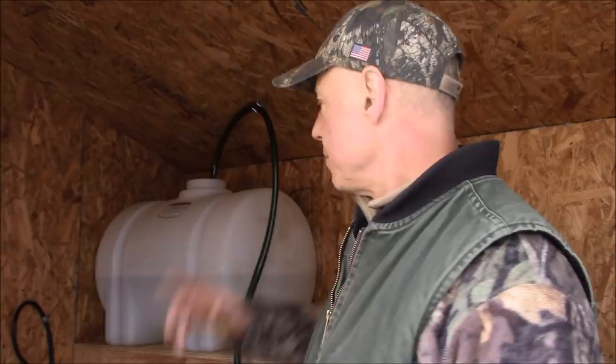I want my drum of water right here in the shed because I'm utilizing the heat generated from the propane freezer to keep my water from freezing, so I can do laundry all year long. I hooked up the system, turned it on, and those folks were right — the water would not go into the drum. Plan B: I've got 12-volt pumps salvaged from old campers. I inserted the 12-volt pump, hooked everything back up, and it works like a charm.